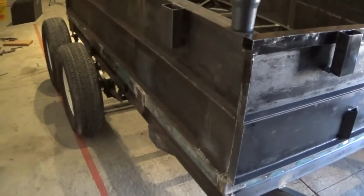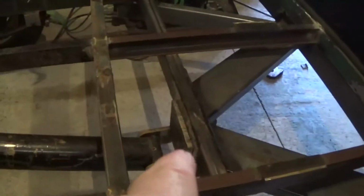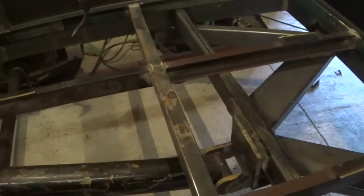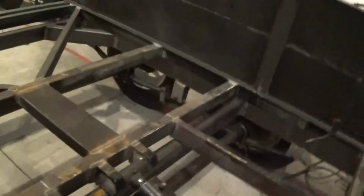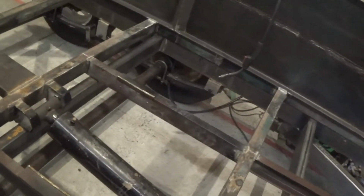So basically what I'm looking at is just a ton of welding that needs to be done. I'm going to talk a little bit. On this Ryan Ram bracket, I need to make some finish welds on that and tie in the back. A little bit of cleanup in here, unpin the ram, flip it upside down, and then repin it both on that bracket and then on this bracket up here, the Grayson bracket, and get that done. And then get the material for the bed figured out, make a final decision on that and get that in there. But overall, it looks pretty good.